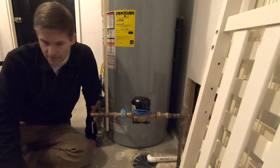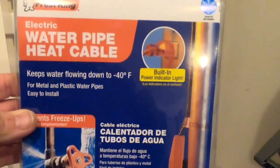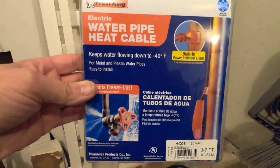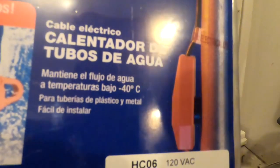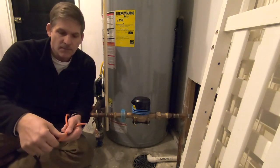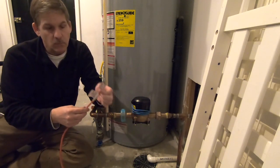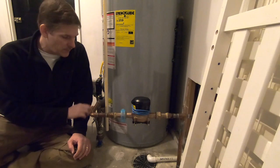You're going to need an electrical cord, electric tape, and this stuff, which is called heat tape. We'll have a link in the description below if you're looking for something like it. They come in all different sizes, so be sure and get the right size. They can't be too long — worst case, you can go over the pipe and come back down the other side. Measure the length and make sure you get the right size for your application. This heat tape comes in various lengths, with a thermostat and a plug that's lit, so once we plug it in we can see that it's active.